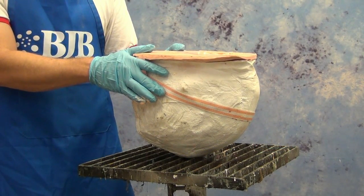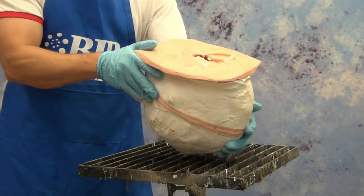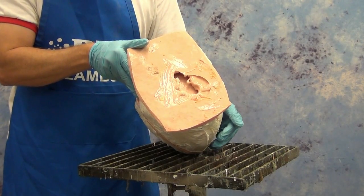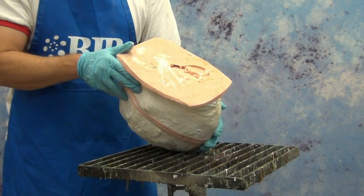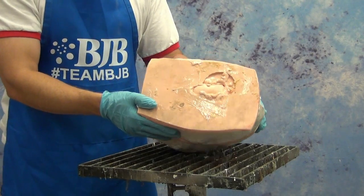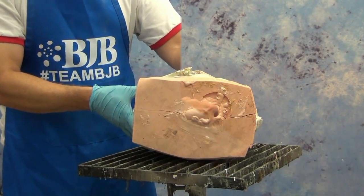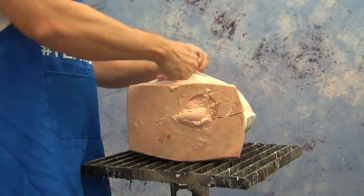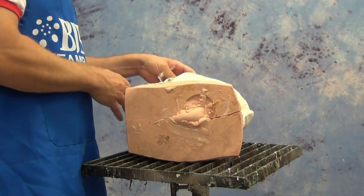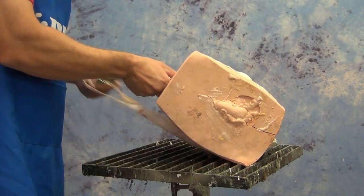Once the foam is poured into the mold, I slosh it around to make sure it fills the ears and any thin or undercut areas. Ears are very difficult to get to fill when you pour expanding foam into a head mold — if it doesn't have the right amount of back pressure or a good pathway into the ears, it won't fill them. Taking a few extra seconds to slosh the liquid foam around inside the mold does help improve surface quality.